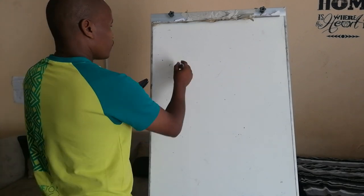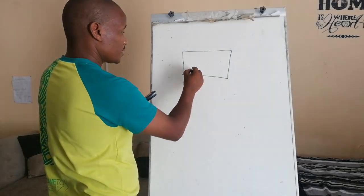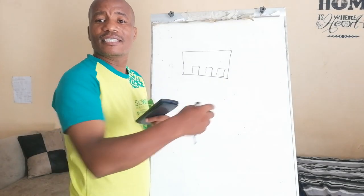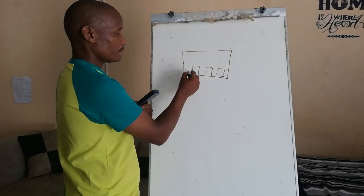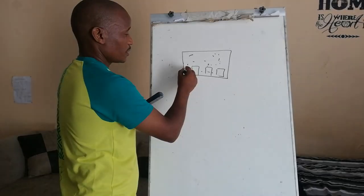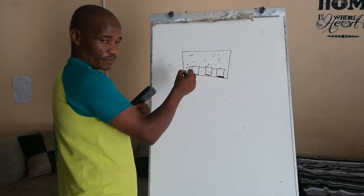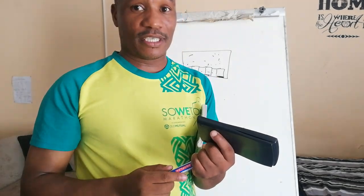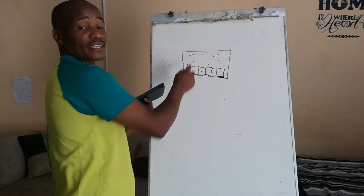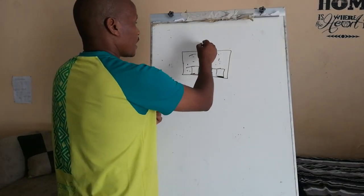Let's say, for instance, guys, this is the main tank of a transformer, and this main tank has coils in it. There are only three things in the transformer tank: the coils, the oil, and of course the core that keeps these coils together, and then they are isolated from each other so that there shouldn't be any short circuit. If there is a short circuit of some sort, we call those faults inside the transformer tank the incipient slow developing faults.